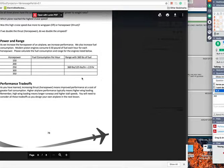So what I hope you would see is that up here you almost get 5 hours. By the time you get to 350 horsepower, you only have 2 hours of fuel. All right? So you can only fly 2 hours. Now, granted, you're probably going to go a lot faster, but you're going to go through fuel. So you as an engineer have to make this trade-off. Yes, I can go faster, but I'm going to use more fuel. Wow, now I'm going to have to make my plane stronger because I have to carry bigger tanks to carry the fuel. It's always these trade-offs.